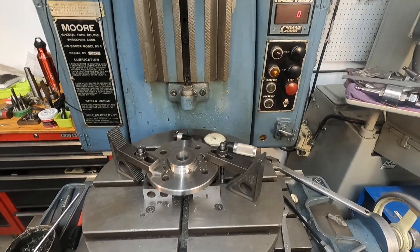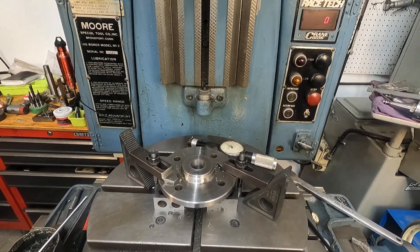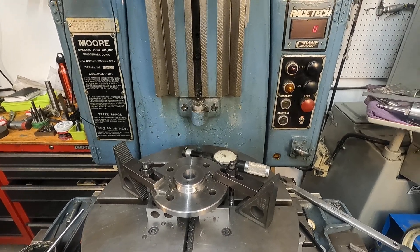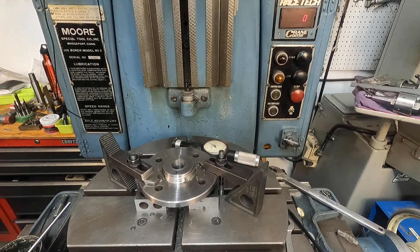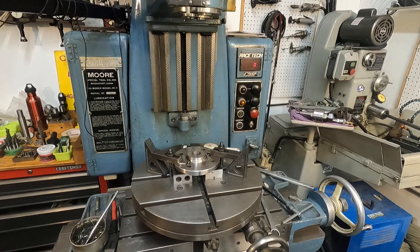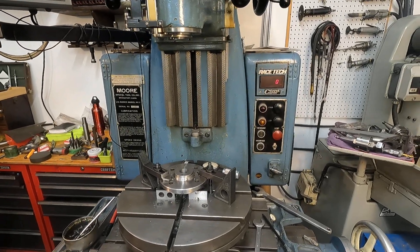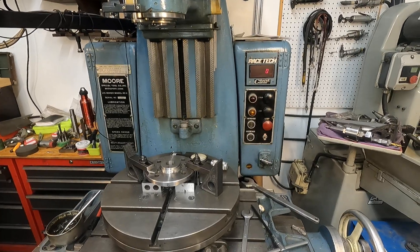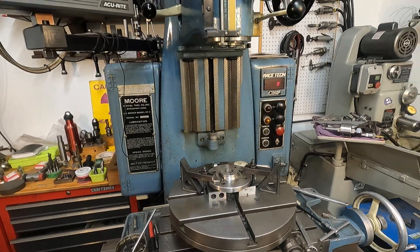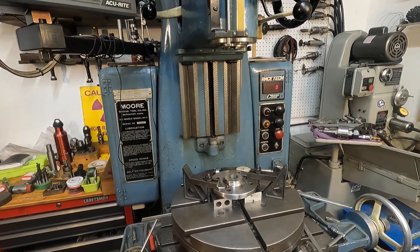Bearings are pretty forgiving, but when you work with precision bearings you want to get to what's called a line-to-line fit — where the bearing is very close to the size of the hole. With this machine you can get quite a bit closer. On a really good vertical mill you can reach those accuracies if you're really careful. Some of the things I do here will hopefully be helpful toward getting consistent results.